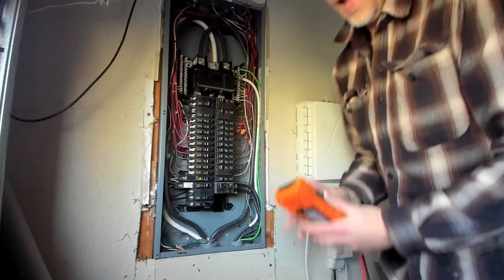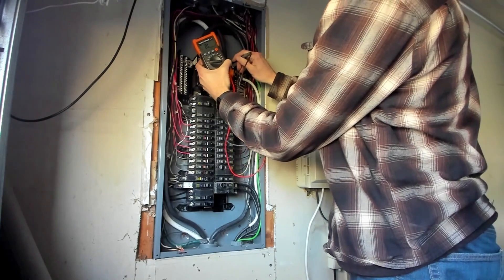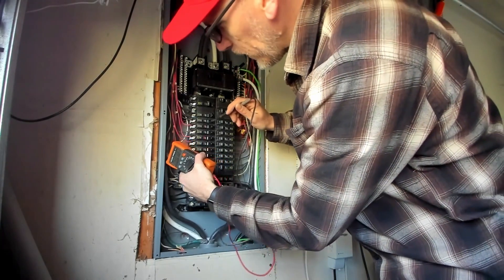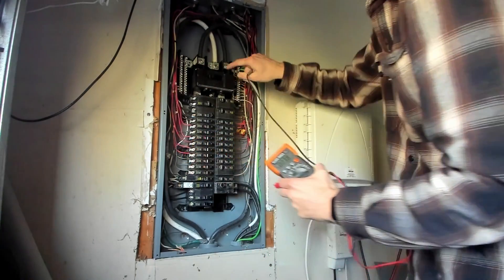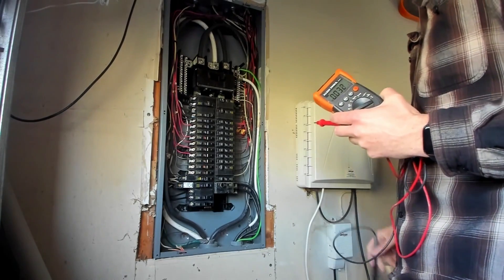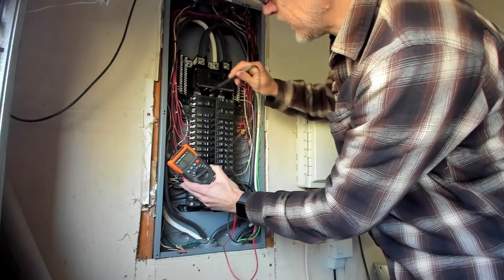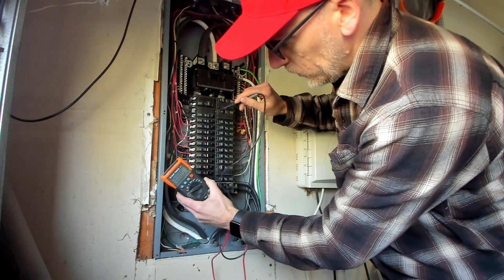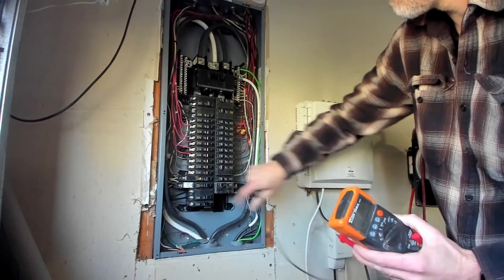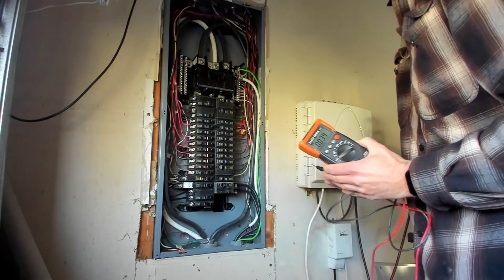The service has been turned on outside. I'll double-check - I've got 240 volts there. As I mentioned before, none of this panel is energized because this main breaker is turned off - this is all off. But as soon as I switch it over, it'll energize the whole panel. I can see my lights are on, so it's working so far in the house. Let me look at a couple of these - see the power here, it's up at 120. This is the new one we just put in - there's no voltage to that obviously because I have it turned off, but I like to get it tested. Now I'm just going to switch it forward - got solid voltage there, so it's at least working to there.